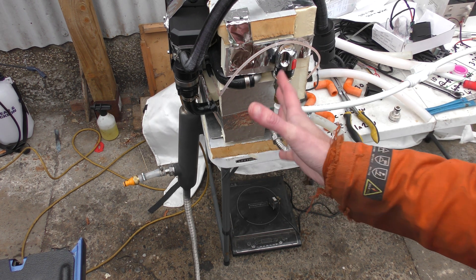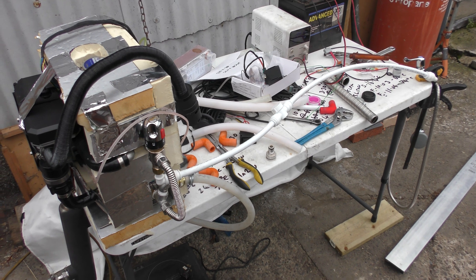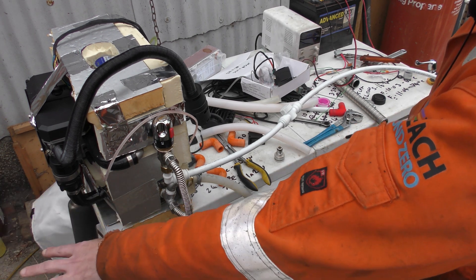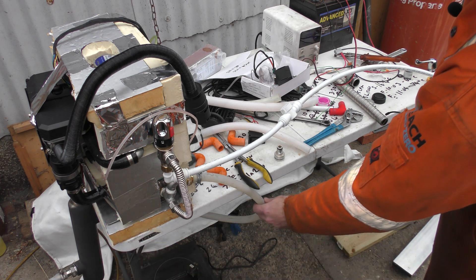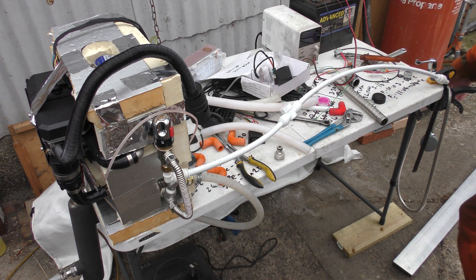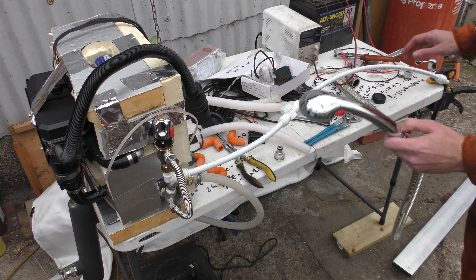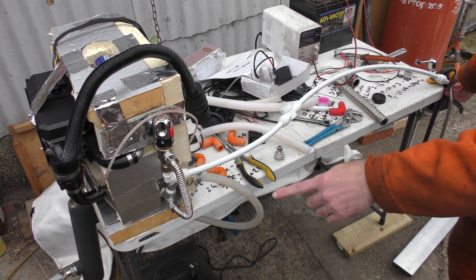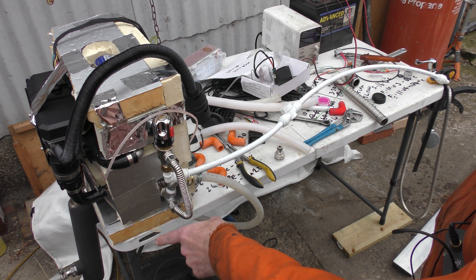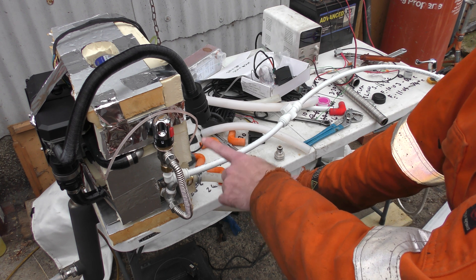But there is a caveat in this setup. Cold water comes in from the tank, pump, or mains, goes into the heat exchanger and into this pipe — fine. Then it gets heated up further and goes out to your shower head or tap. Now, obviously you can turn the shower head and taps on and off. When you stop flow through the exhaust heat exchanger, it will just keep getting hotter and hotter until you're making steam — which means this pipe and your heat exchanger are now building pressure.